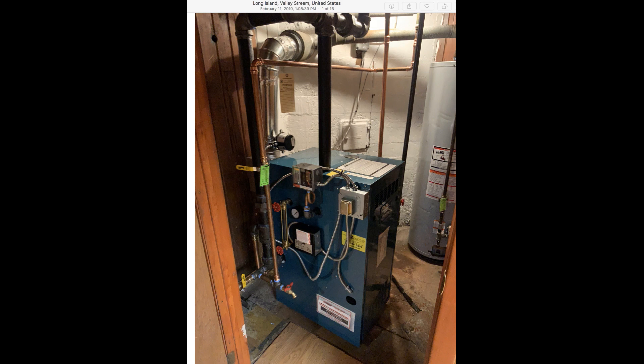Hey, what's going on everyone, this is Mike from the Pipe Doctor. Before I go into the video clips filmed on site, I want to show you this example of what a steam boiler in a residential setting should look like. This is the Burnham Independence Series IN4, which is 105,000 BTUs. You'll notice all the controls are on the left-hand side of the boiler — this is the front access panel — and all the piping is threaded black steel piping carrying steam.